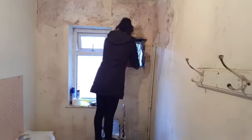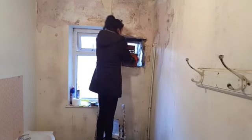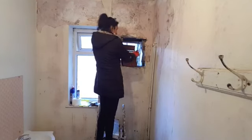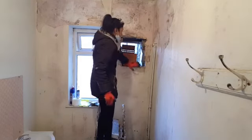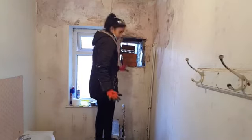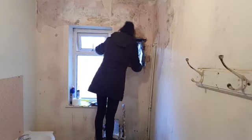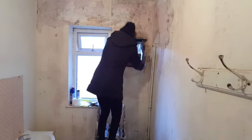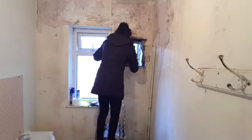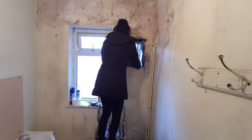Now, it doesn't have to be brickwork that looks that tidy when you're tidying up in between the bricks and when you mortar the side bits, because I'm going to have initially a plaster put on it. So I'm going to put a lime plaster on top. So that should be okay. And yeah, just get this in best I can. Like I said, there'll be mortar bedded at the bottom first, and then these going in. Like so.